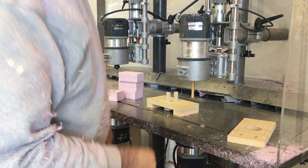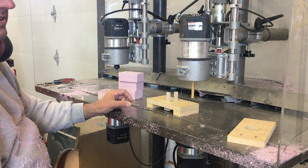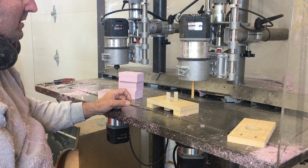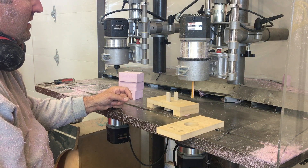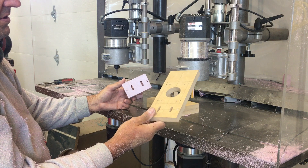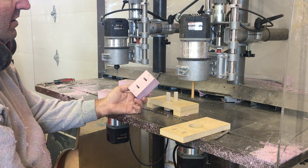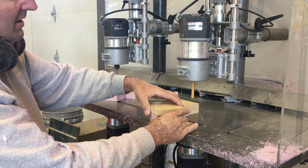One other piece part that goes into these little things are the tunnels for the intake port and the exhaust port, with the flange to mount the carburetor and flange mount the exhaust pipe. Those are kind of a challenge to mount, so what I decided to do was I just routed myself again with my little setup fixture — I just made myself a couple of little mounting slots, and those mounting slots are actually the centerlines of the intake and exhaust port on the actual part.